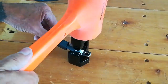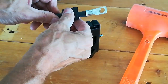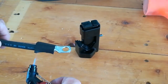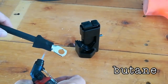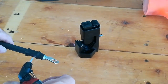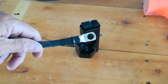You can attach that tool to the workbench with a couple nails — I opted not to, I probably should have. You can also use it in a vise, and I might try that next time. I'm using a small propane lighter to shrink the tubing. And it made a secure, clean install. Overall I'm happy. That little crimping tool ran about $20 from Amazon.